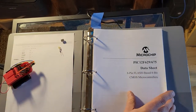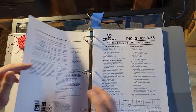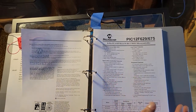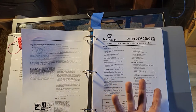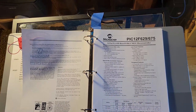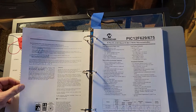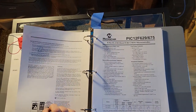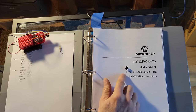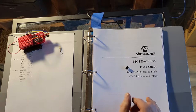I'll explain what this little chip in particular will do — that's inside this download. It can be an analog-to-digital converter, a digital-to-analog converter, an operational amplifier, a comparator, or just purely digital output. They also do things like serial communications. It has about 1,000 bytes of memory, 64 bytes of RAM, a whole bunch of EEPROM, and 6 I/O ports. If there are two pins used for power — 5 volts and ground — the other 6 pins are used for I/O, so you can do a variety of things with that.